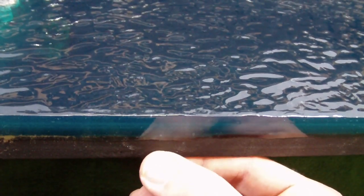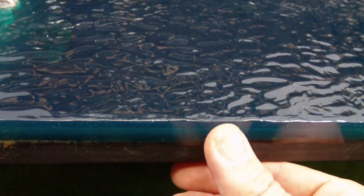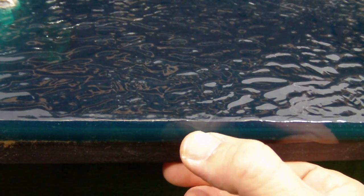How deep is the pour itself? Well, here you can see this is about a half inch here, and then this is about a half inch of resin, and you can see the stratifications of the layers as I poured them along the line. But these two boards combined took almost two-thirds of a gallon, heading for the three-quarters of a gallon mark. So that's no small amount of plastic to pour. And this one took maybe 6 pours, which I can only do 1 to maybe 2 a day, depending on the timing of the pours. So that took quite a while to lay down those layers.